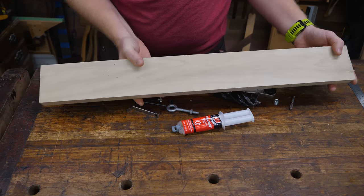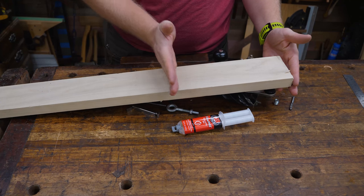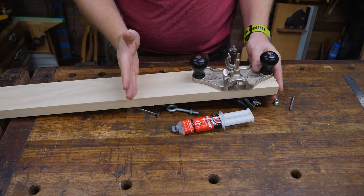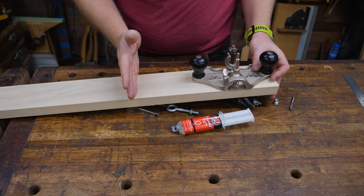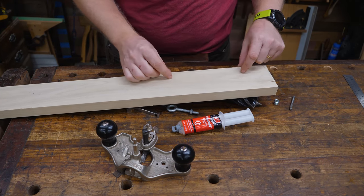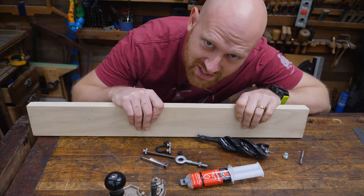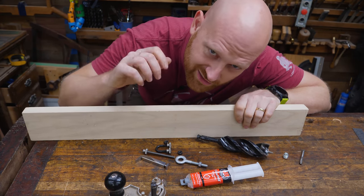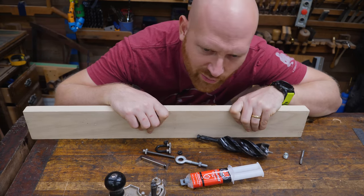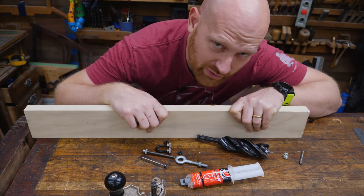For the lumber I'm going to be using hard maple — one inch thick by three and a half inches. I'm actually going to make a fairly long one because I want to use it to do cheeks and tenons. Normally the router plane is only about eight inches, so I'm going to make mine a little over a foot, maybe about 14 inches. I'll also need another piece to glue onto the back, which I'll cut from the same stock. Hard maple is very nice and durable. Oak would work perfectly fine though it is a little splintery; ash is similar. Something hard from South America would also work fantastic.